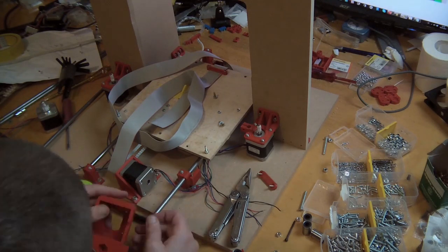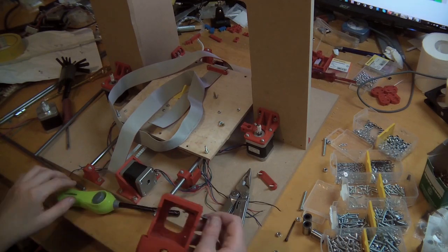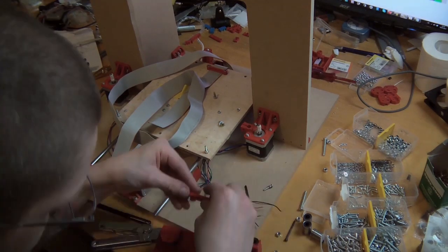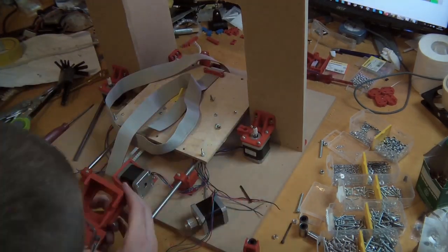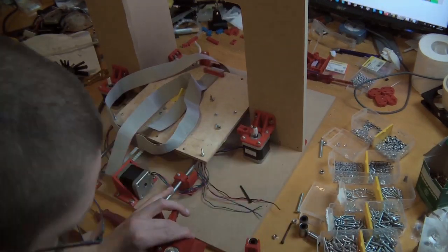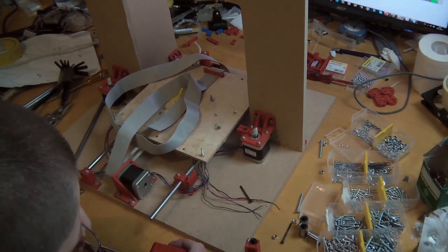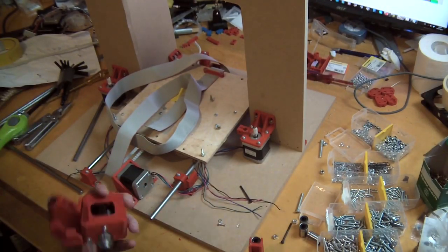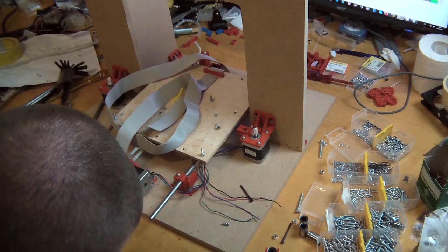There is actually a lip on the right side of the motor bracket. At first I thought my motor didn't fit, but it actually does — you just have to put it in straight and then rotate it while it's in the cage. But because it's such a horrible print and the height is all messed up, the screw holes don't fit perfectly, so there's a lot of re-drilling and re-heating. That's a part I definitely need to redo as soon as possible — I can see it just breaking.